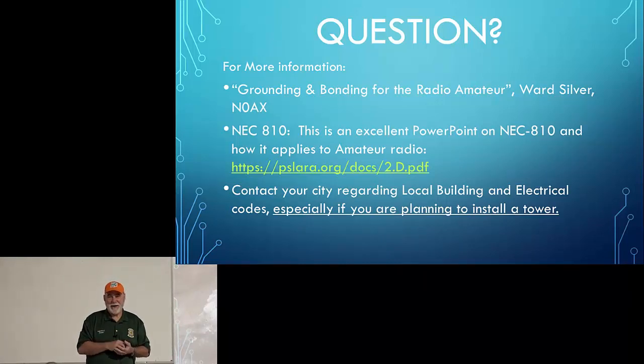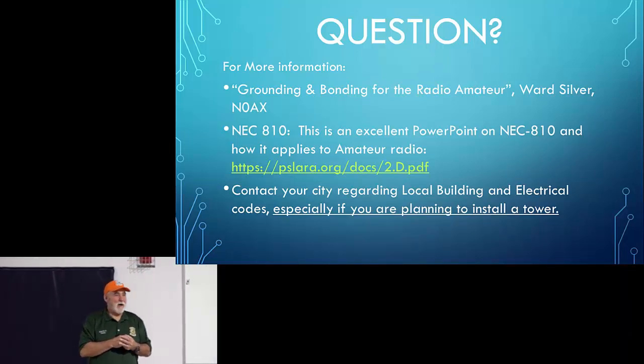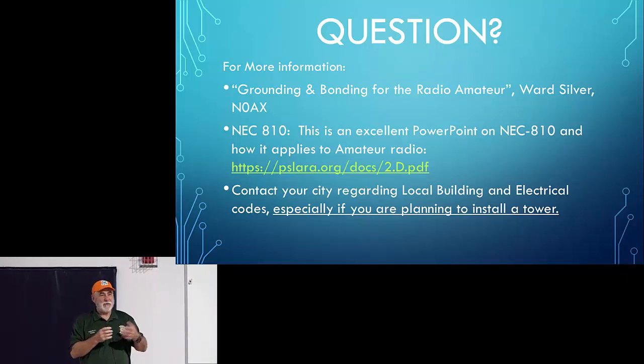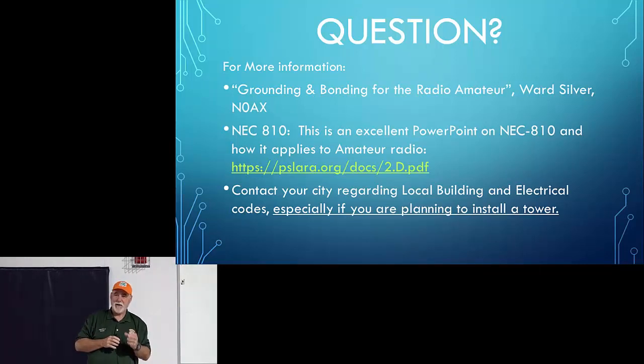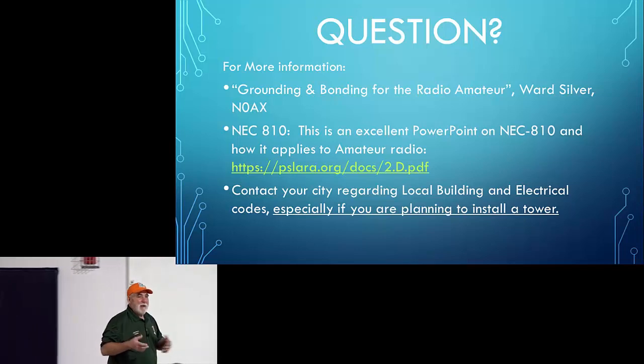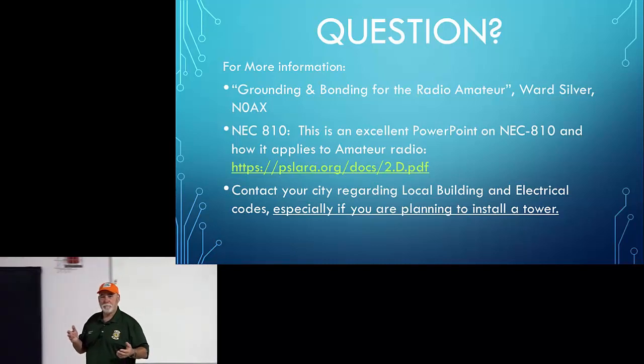So, I'm going to single Todd out because I like to make fun of him about this. We put up that antenna at Todd's house, and the SWR on 10 meters was, I think, 2 to 1 or something. Todd wanted to get that just right, and I bless Todd for that. I've been there, Todd. Trust me, I've done what you've done, where you just want to get that SWR down a little better, to at least under 1.5 to 1. If you do the math and look at the difference it made, you probably would have been better off going to spend time with your property manager.